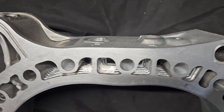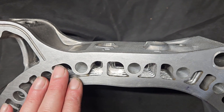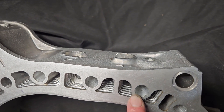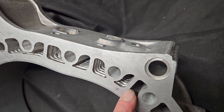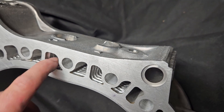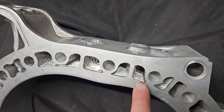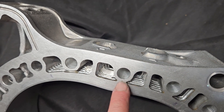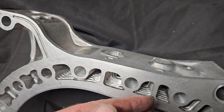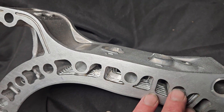There are always trade-offs. Obviously this is time consuming, and you run the risk of damaging a component if somebody were to improperly port it or if the CNC were to slip. But as you can see, mimicking what a heat sink has - basically ribbing - allowing the water to touch more surface area as it passes through, and the turbulence thereby slowing the water down, helps this whole area get better heat extraction.